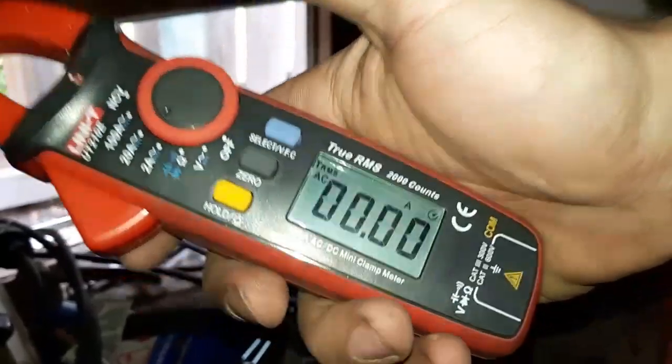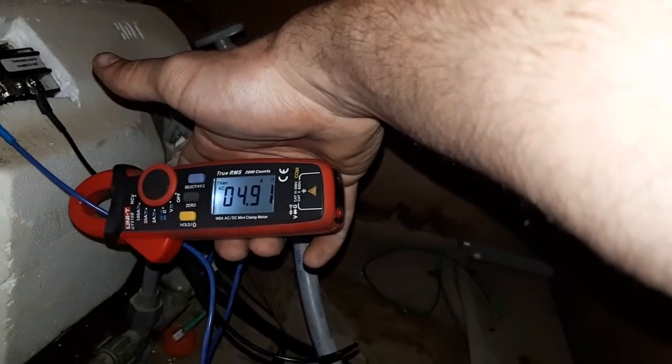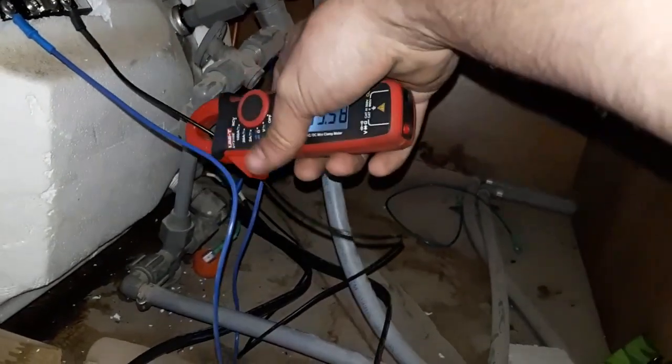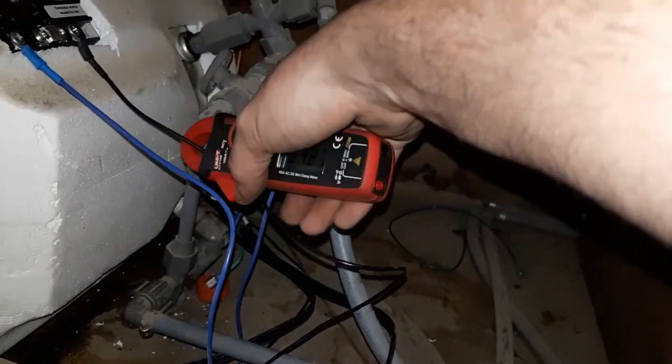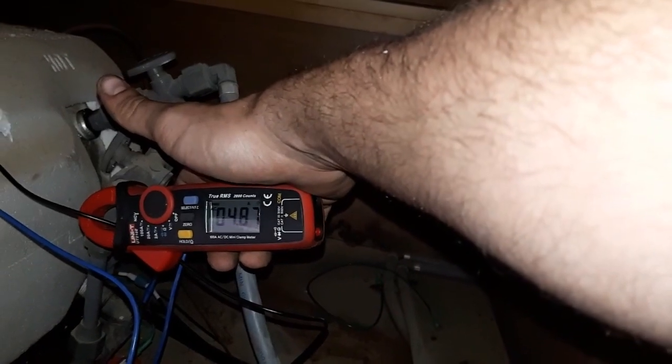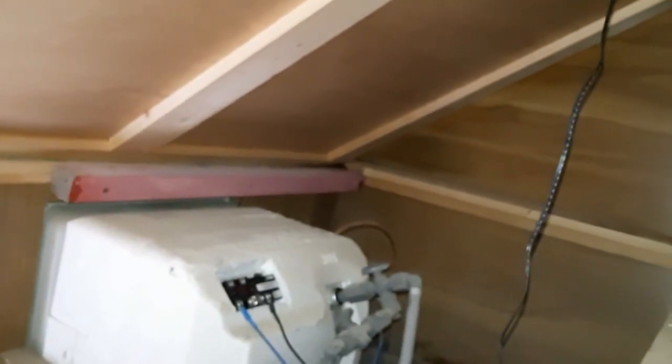Now I'm getting power. I'm also going to go to my amps setting - 20 amps AC - turn on my light and see what this bad boy is drawing. It's drawing 4.9, almost 5 amps. Let me clamp that right - 4.87, 4.9 amps. So almost 5 amps of current. In the grand scheme of things that's a fair bit when you've got a 30-amp receptacle.